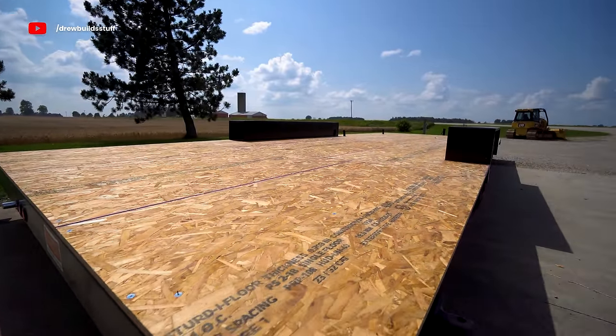I also just cut up some scrap 2x4s into some 1/4 inch sections to be some furring strips. And these just raise out that tongue and groove paneling an extra 1/4 inch to get them at the reveal I wanted them at. And now I can start installing a bunch more clear cedar tongue and groove.